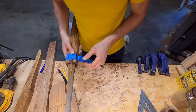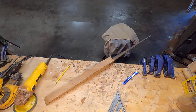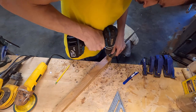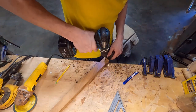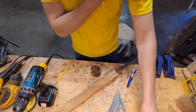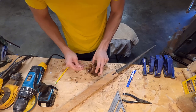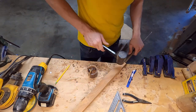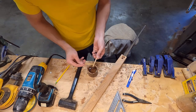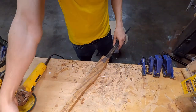Before I shape though, I do need to put in the pegs. The reason why I fill it up first is so that it fills in all of the little cracks — I'm actually going to be shaping and grinding away all of that excess epoxy. These are quarter-inch holes that I'm drilling crossways. Normally with this type of joint I'd use wood glue, but because the core of the marlin bills is now epoxy from filling it, I'm going to use a 15-20 minute epoxy for the cross pegs — it adheres better with the epoxy core. The epoxy will still hold pretty well to the wood, and the pegs aren't going to have a whole lot of stress on them, so I let that sit for about an hour and then I can start shaping.